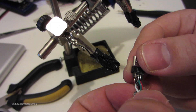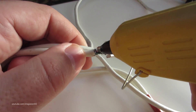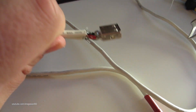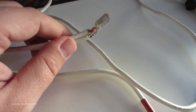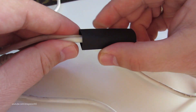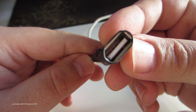You can use any wire just as long as it's small enough so it doesn't interfere with the case. When you're ready, put hot glue around the USB connector especially where you join the cables together, just so there is mechanical protection so the wires don't break over time when you use the cable. Put as much as you like but don't put too much, just enough to cover it. Then place a heat shrink on top of both cables and the heat shrink does its magic, which looks pretty good.